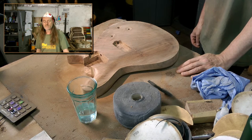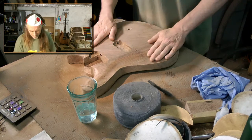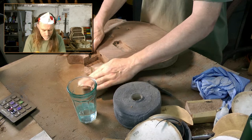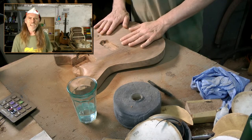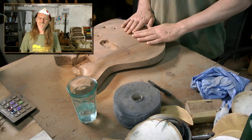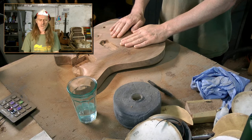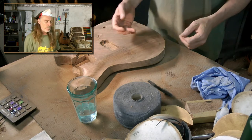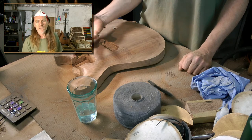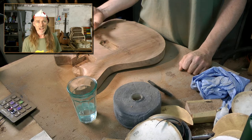So building on from that, the other question, I'll ask it super close if you've half answered it. Is paint thinner okay to use to tack clean off dust after sanding? Yeah, it's just a bit nasty. So we don't splash it about unnecessarily. I would rather use what we call a tacky rag. So you can buy, they're called tack rags or tacky rags. A tack rag is basically a sticky rag.